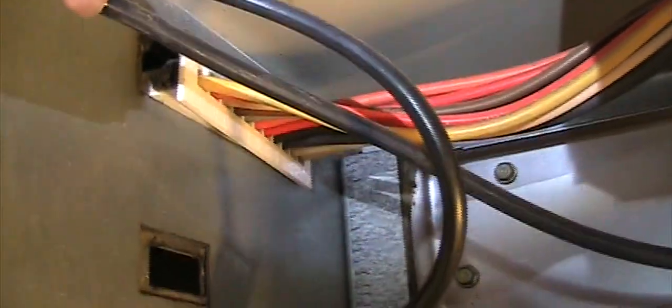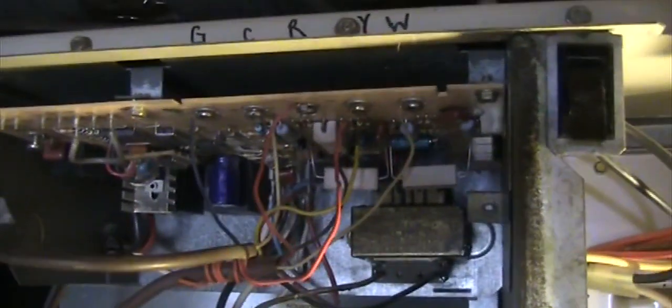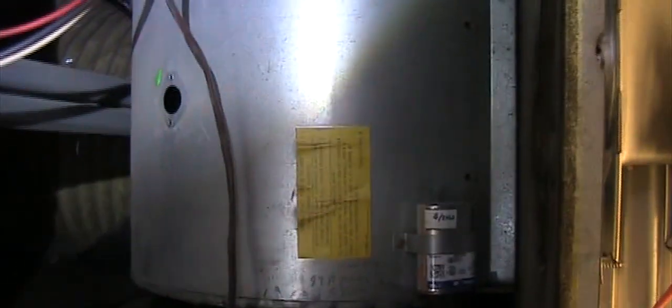The motherboard. So last is the motherboard. I just pull out a little bit, so I will be very careful, just strictly pull it out. And then after that, I'm going to remove the top screw holding the motherboard. Okay, the connection of the harness to the motherboard is out, so I believe only these 3 screws or 2 screws are holding it. So as long as this one is out, I can remove the screw here and another screw up there, which is holding the motor and the blower. And I'm going to strictly just pull it out this way.